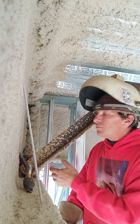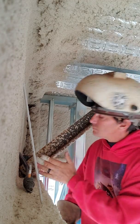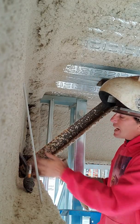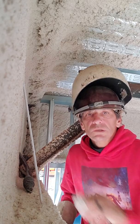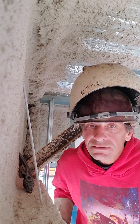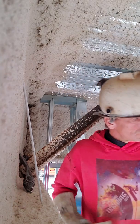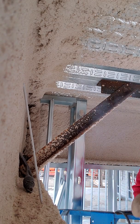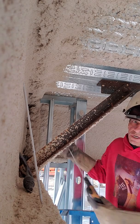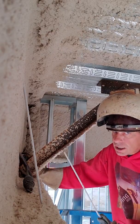You can make a mock-up. If you have a beam at home, just put a slap plate — I call it a slap, anything's a slap. Have an angle, cut it like 10 inches, tack it, and do these welds. Cause these welds happen in the field, and if you're really not good at it, it's a nightmare — the weld inspector is not going to be a happy camper. It's one and done. Get it right. It's all about the rod angle — same heat, everything's the same heat here.